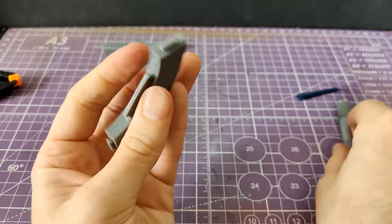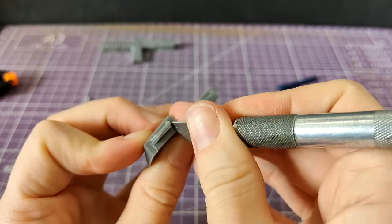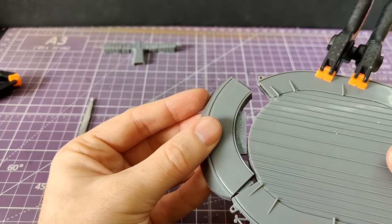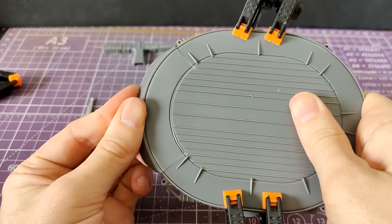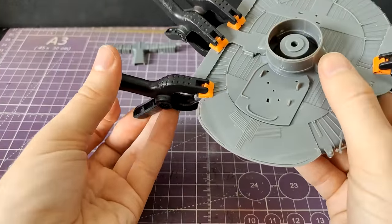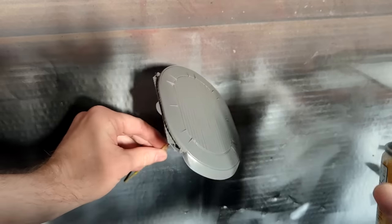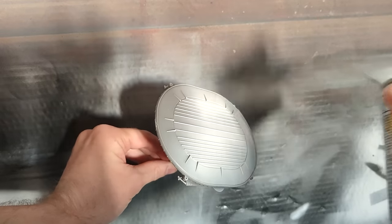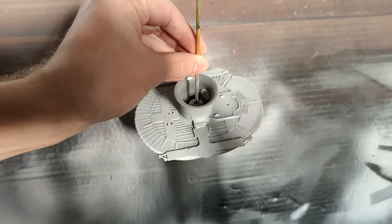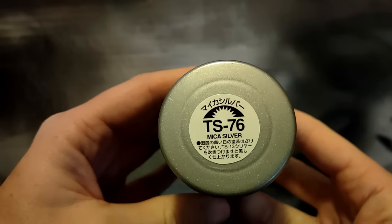The reference I made to the modular construction is actually to do with the colours. There are really three colours: silver, white, and blue. The idea was to assemble the hull and spray it silver, assemble all the bits that needed to be white and spray them white, then paint the remaining parts blue. In hindsight, I would not glue the lower propulsion ducts onto the main hull before spraying — I would have sprayed it before that point. However, to get the intake ducts to fit nicely, you kind of need to have the lower ducts on first.